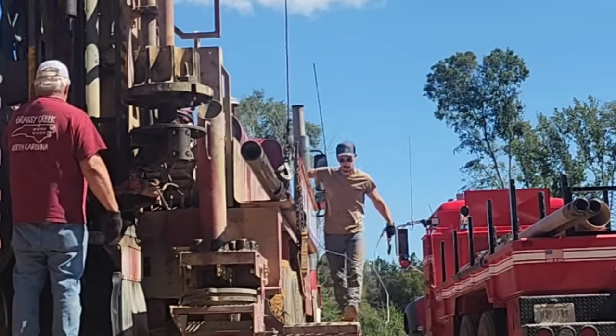Now I'm gonna go back outside and we're gonna do a little bit of hand filling with a shovel so we don't put the pipe or the wire in any kind of kink. We wanna make sure no big rocks are sitting below the pipe or on the pipe. Right now that looks pretty darn good.